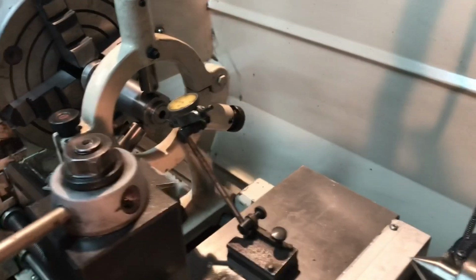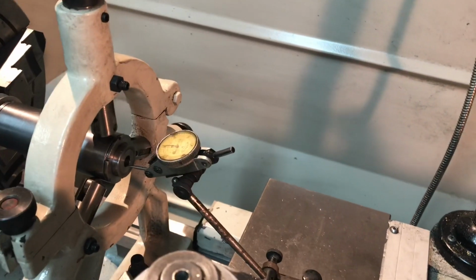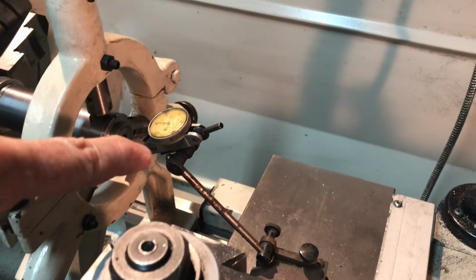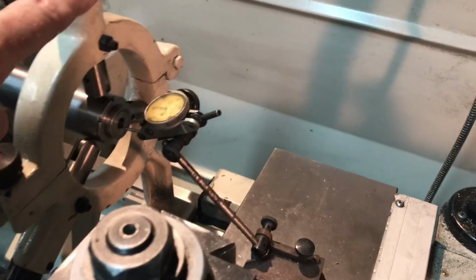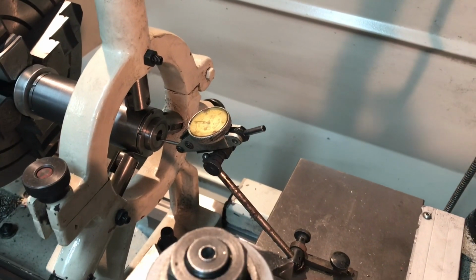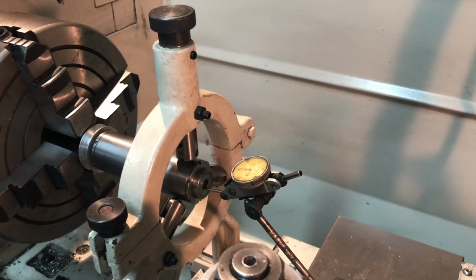It's the final step of getting things set up before I bore the 40-degree taper for the WW collets that are going to hold the tools. I got the 4-jaw chuck on, got that carefully centered. I carefully centered the snout. I put my little half thou Interapid indicator here in its little stand, and with a little bit of fine tuning with the different pieces of the steady rest, I've got it within plus or minus a thou on either side. It's about as good as I can get it. And then I used my little 10mm wrench and tightened down the nuts there.